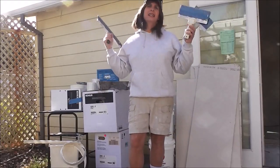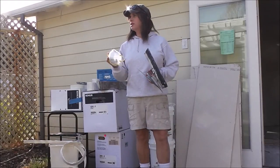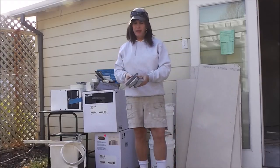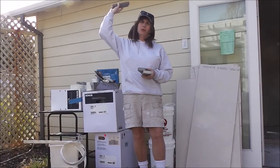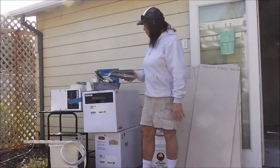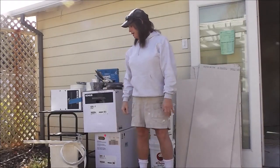Everybody dreads the sanding because it's such a mess. But I also have respirators to wear, because you sure don't want to inhale that dust from the drywall application when you're sanding down the dry mud. And I have sanding blocks which make it real easy. There are also overhead pole sanders that make it real easy to get the drywall sheetrock super level after the taping and mudding. We go back and hit all the screws that aren't on seams with mud — a couple of applications there and we get everything ultra smooth.